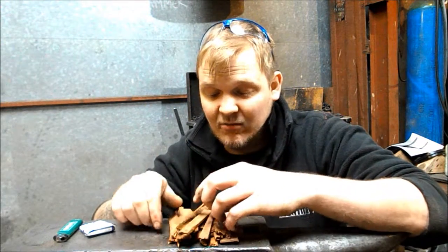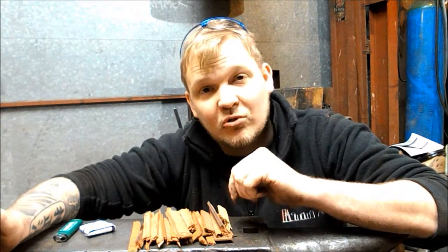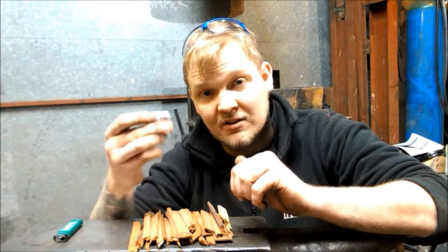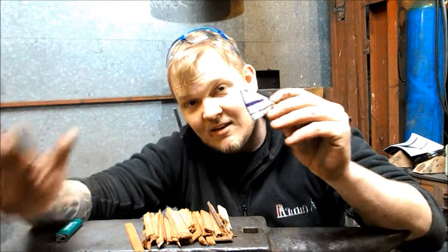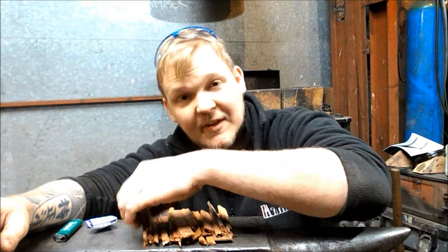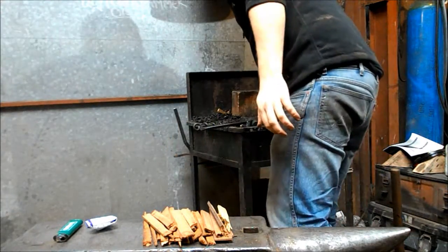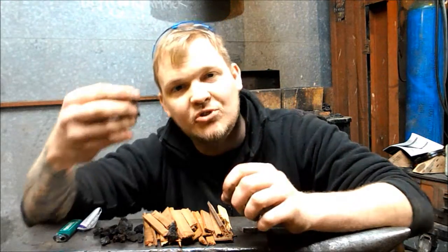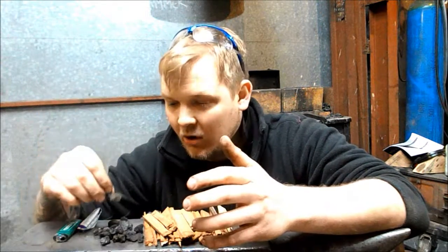I've chopped it up into about three-eighths by three-inch pieces — so 10 mil by 75 to 100 mil long pieces. It doesn't really matter too much. A good handful there to get it started. I use coke, and coke is notoriously hard to light, and so is coal. So you could mix a little bit of charcoal in, or use fire lighters. The premise is something that starts burning easily at a lower temperature that builds to a high temperature, which in turn lights the coke. Coke is reduced coal — basically it's been baked in an oxygen-free environment. It's like the charcoal version of coal.